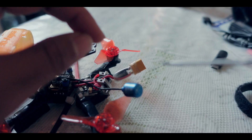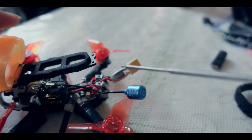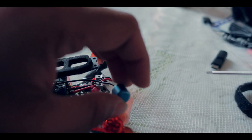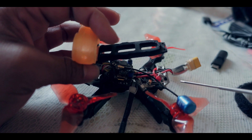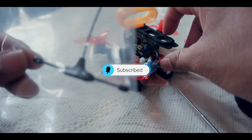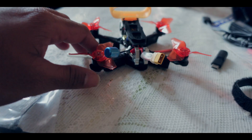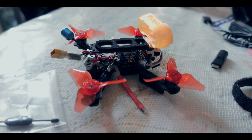For antenna consideration, I am using this iFlight Sima antenna. Ideally your antenna should go all the way to the top, but I was running it through the back — you can get more range if you keep it in the front or somewhere. In our transmitter, we are running a TBS Crossfire. You can run the crossfire making it come out from the back. TBS actually now offers this micro antenna. Previously these were regular antennas, but now they offer micro antennas — very small length — and it actually fits perfectly at the back. When you're doing long range, I think the ideal setup is to have it come through the middle so that your whole quad gets coverage.